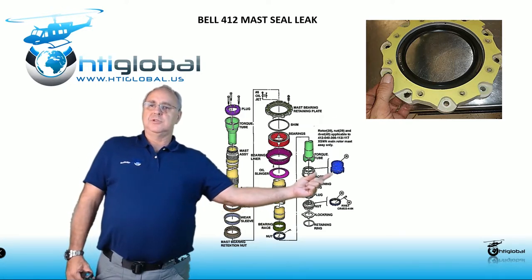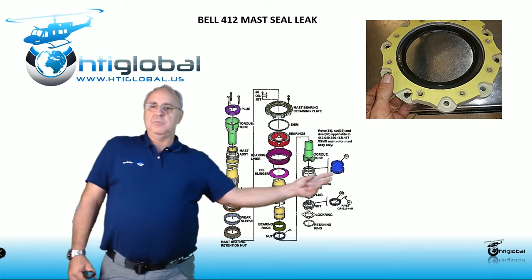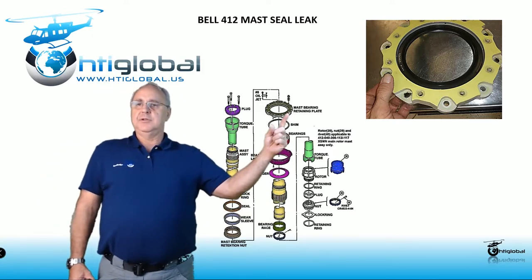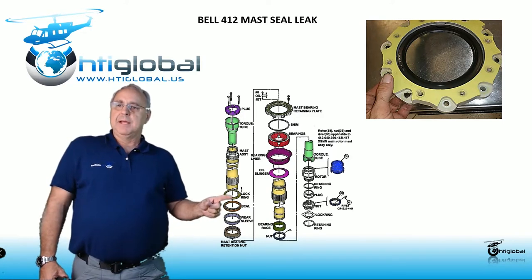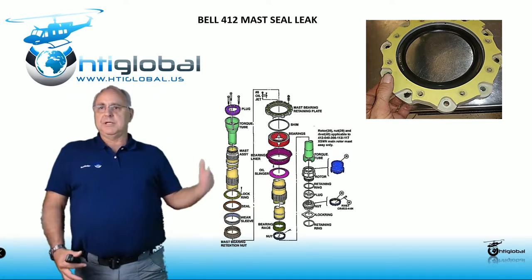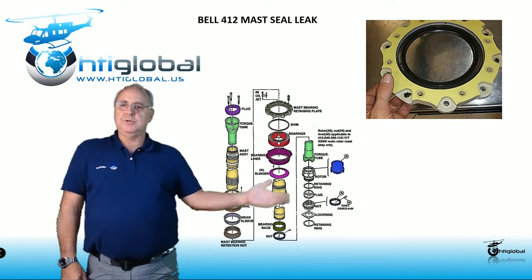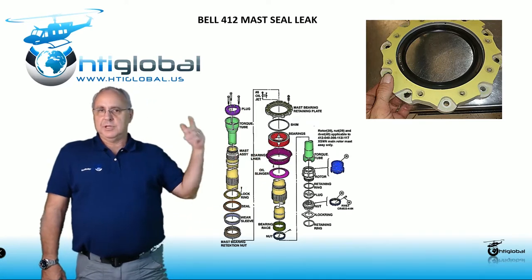The reference gear — the new one is riveted, the old one is bonded. These cannot be removed in the field. The torque tube itself you can remove in the field. The other part you can remove in the field is the retainer, where you're going to have the seal, and also the lock for the nut. To remove that nut you need special tools that will cost a lot of money, and this is not a field maintenance process. In this class we're going to discuss the locking, the seal, and the retainer caps — pretty much field maintenance and replacement of the mast seal.